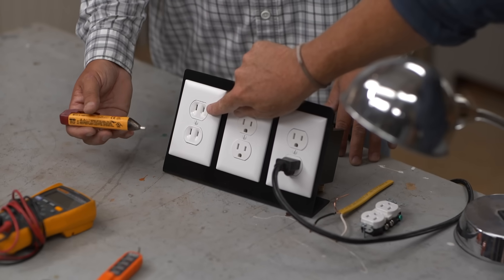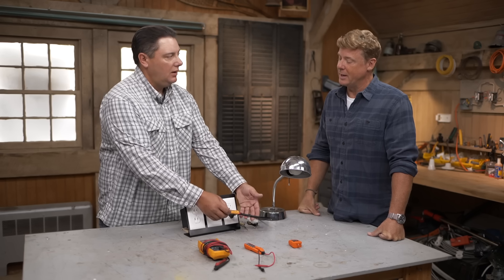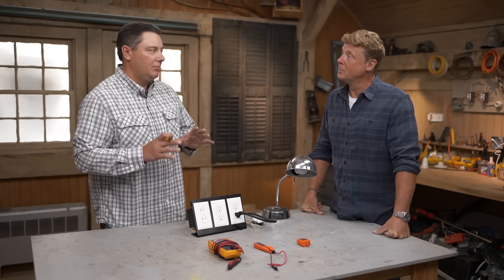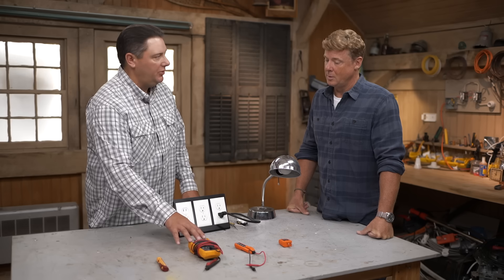And it's not just for plugging into a receptacle. If you've got a wire exposed or a cord coming in and you want to know if it's live, just touch it — same thing. Now the one drawback to these is they're really, really good, but they're not perfect. Because it is contactless, you can get phantom readings occasionally. If you put it on the wrong spot, you may think it's not energized when it is. So you always want to follow up with an actual contact tester if you're going to work on something.